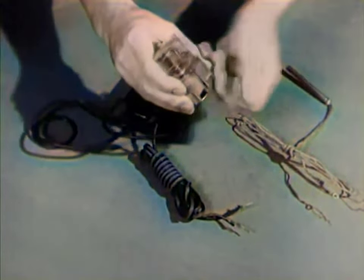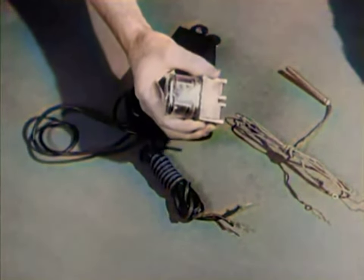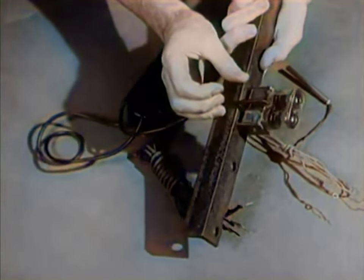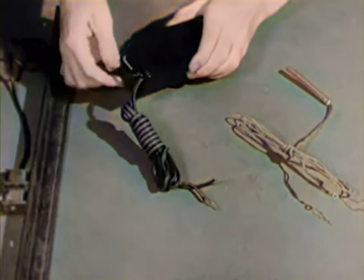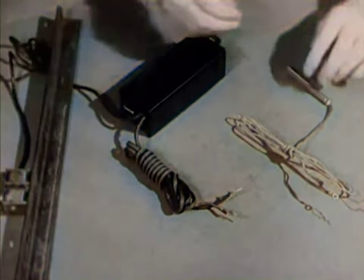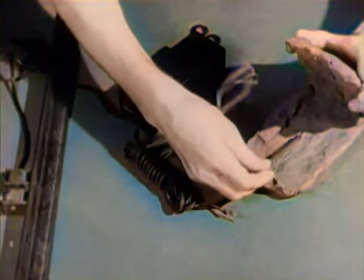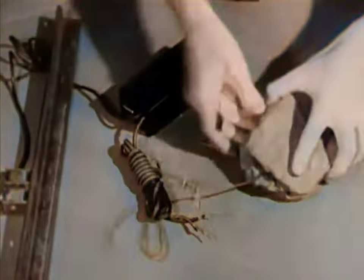The photocell, attached by magnets to its target, must be so placed that it can literally see the roadbed. Sensitized by light, this cell builds up an impulse from an accumulation of daylight. And when this light is suddenly removed — as happens when a train goes into a tunnel — the impulse is released and transmitted to the relay unit, where it is amplified into a charge sufficient to detonate the explosive. This electric charge activates the electric detonator, which is inserted in the explosive.